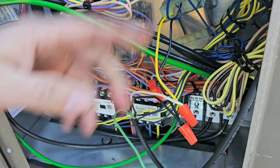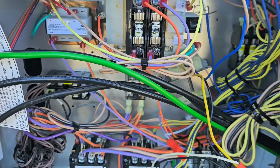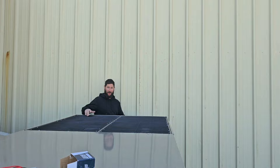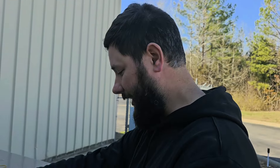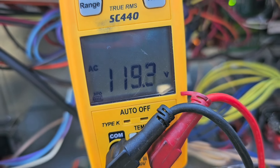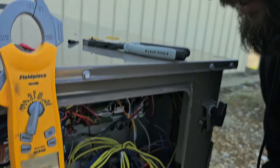Nothing exploded — we're on the right path. Looks like we got a UV bulb that's lit. Don't stare at the light. Now let's use the meter and measure the secondary side of the transformer and see if we've got 120 volts. We got the meter on volts AC. It's pretty much right on 120 — it's 119. So we got the voltage we need. Now we need to tie in the ground wire, and that's it.